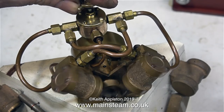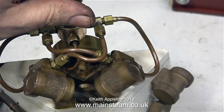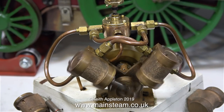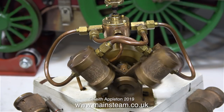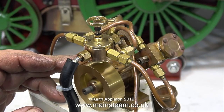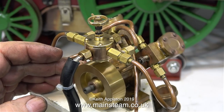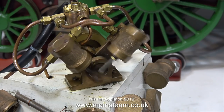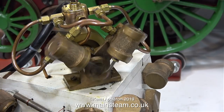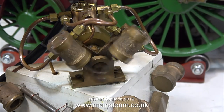In the series 'How to Build a Blackgates Twin Steam Engine', I will explain some of the techniques that I use as I put the engine together. It's essential that when you put an oscillating cylinder engine together, the port face contact to the cylinder face contact must be perfect, and during the construction there is a special way to do this — more about that in the series. And that's it for this video: the engine runs okay, the reversing valve reverses, and when I put pressure against the flywheel, the engine is surprisingly powerful. I look forward to constructing the V4 version. When I get hold of the cylinder and push it against the port face, the hissing stops — so there is a problem with the left hand cylinder. Thanks for watching, and I hope you found it useful.